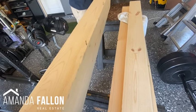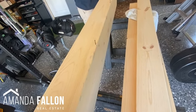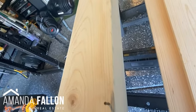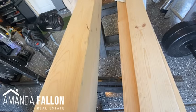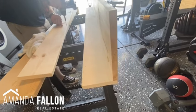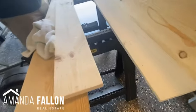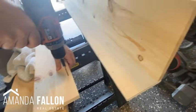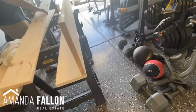The next step is to assemble all four boards into a box. You want to make sure your seams or butt joints are smooth and totally aligned because it needs to look like a tabletop. If you have somebody to help you hold the boards straight, that would be so much easier. We use trim head screws for this — I think they're the best to work with. We have the top board and the right side board installed together, and next we're going to install the other side board and then the bottom board using trim head screws.